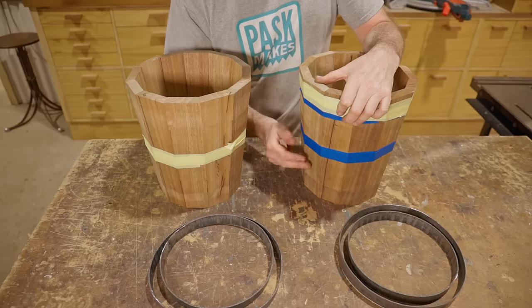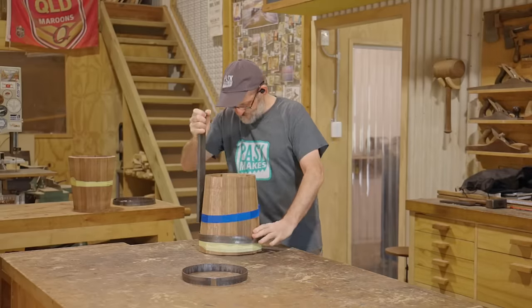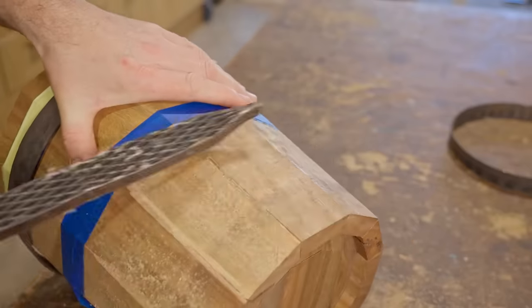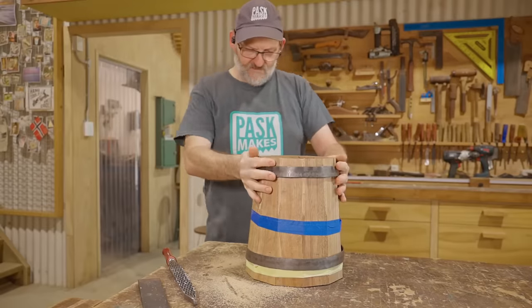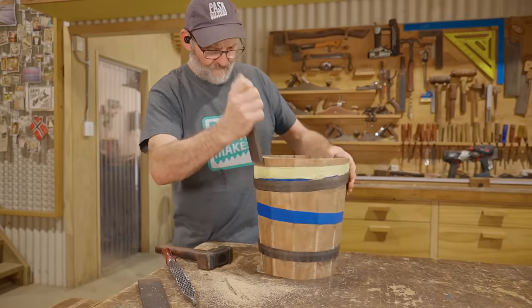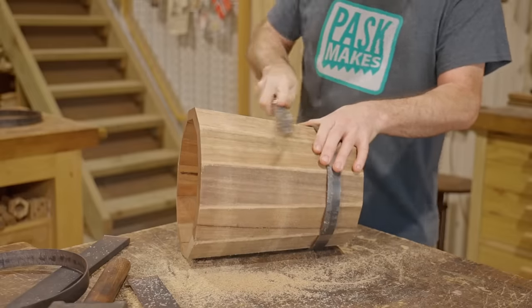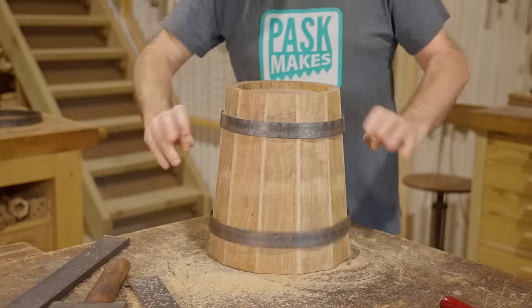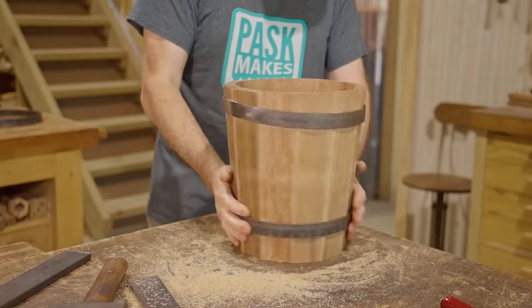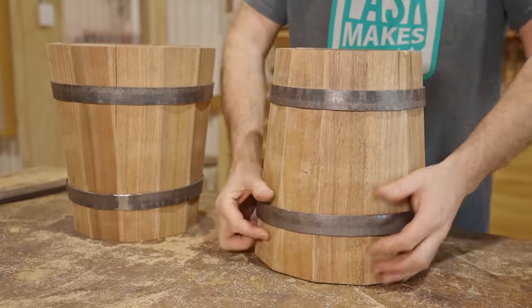So what I'm going to do is take the corners off slightly. I do like the facets and planned on leaving them, but taking a little bit off will give more surface area to grip the inside of the ring. I'll put the top ring on, take down the corners so far, then swap the top ring for the bottom one and finish the other end. I was going to plane them but then I thought the rough finish of the saw rasp may help with some grip. I should mention that I'm using a piece of half inch flat bar to hammer the rings on, and the bigger piece for the lower ring is heavy enough on its own without the hammer. That's much better, but one ring needs adjusting one last time — only took five minutes as I've done a few now and I'm getting the hang of it.